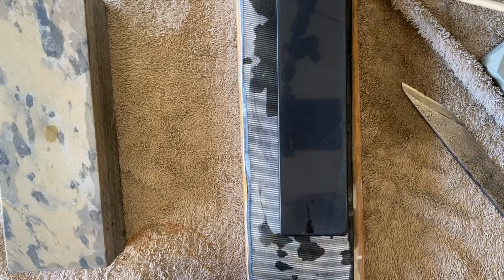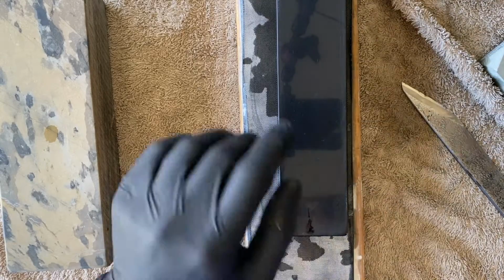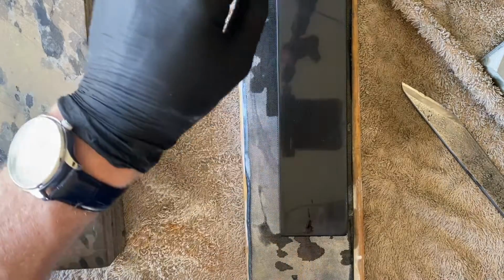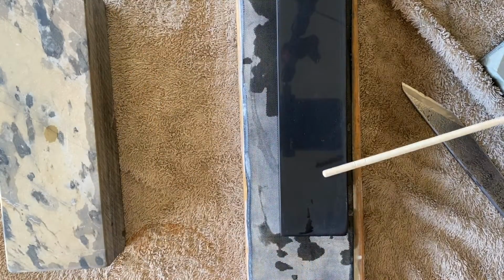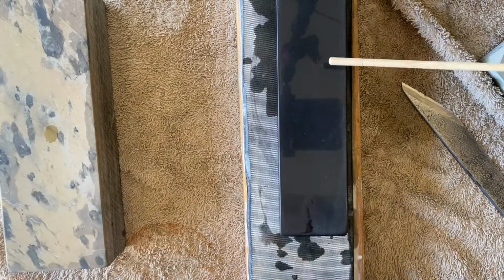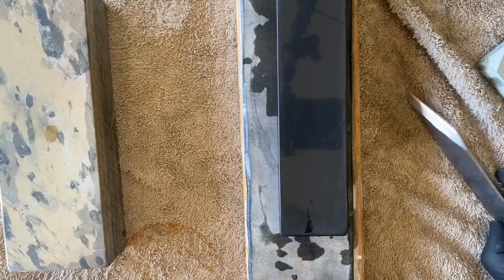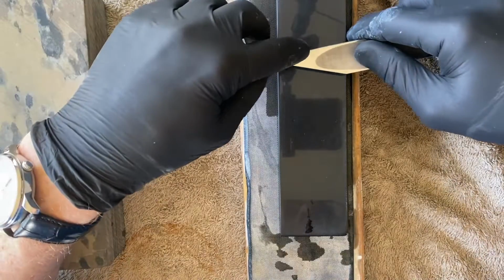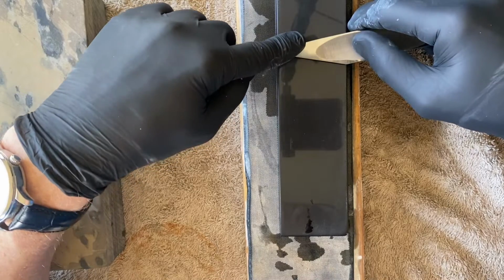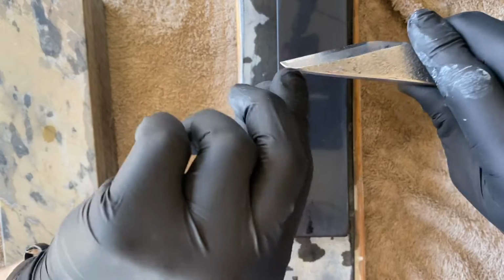Chamfered edges is the other big mistake people slip on. These edges need to be smooth, round, no hiccup, so there's no chance for the edge to bite, especially with straight razors, and cause a lot of damage. The other thing is spine pressure. Generally people, when they apply pressure, it's on the spine, and it should be slightly edge biased, otherwise you're going to wear away the spine.